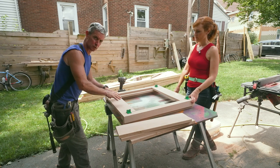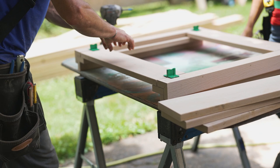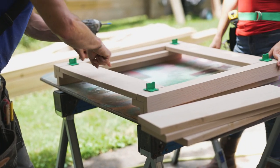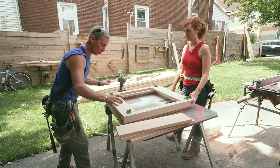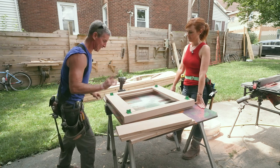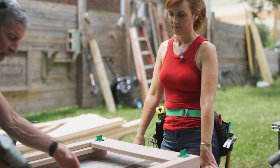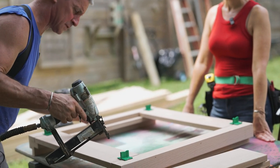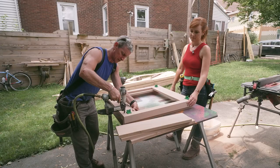Secondly, we can't forget that Acre is composite decking. And as a general rule, composite decking expands and contracts, unlike wood, along its length. Wood goes this way, composite goes this way. So that this thing doesn't grow together, we want to leave a space for the material to move over time. Teresa has a spacer here and here, and we're gonna move up to screws in a second, but while this piece is mobile, we're just gonna freeze it with staples, then we move on.